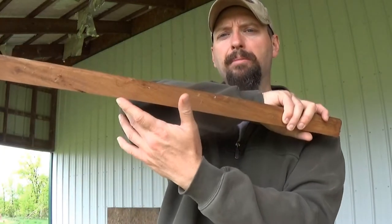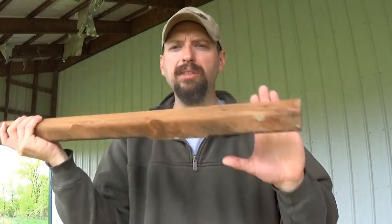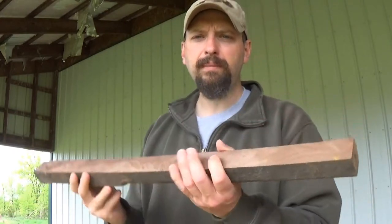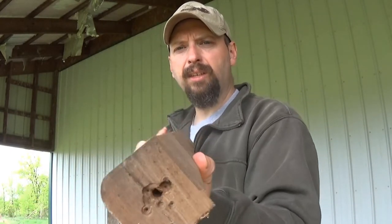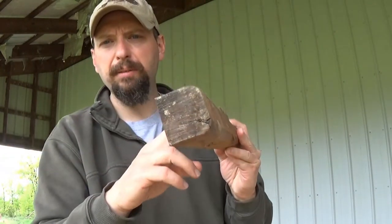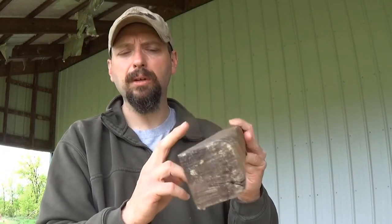This is going to be something that's oversized and it's probably going to go right around my elbow. I got it a little bit longer because I'm going to use the end of it for another project. I'm going to try to put this on the shave horse and use my draw knife. I've seen a lot of Tuka Cam handles that are just a stick right out of the woods — take a green stick, drill a hole in it, epoxy the blade in, and you're good to go. That bark gives you a little grip on the stick to turn it. With this one, I'm going to try to do flats — maybe eight or twelve flats is my end goal.